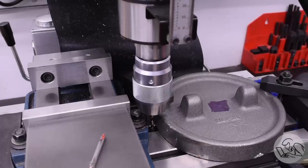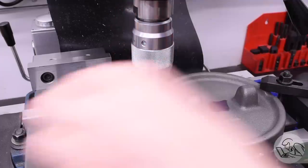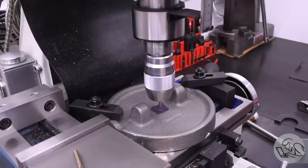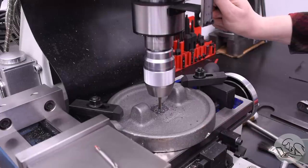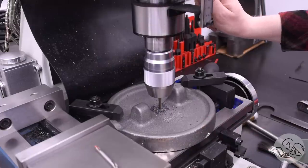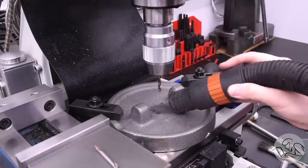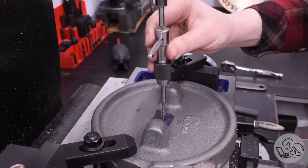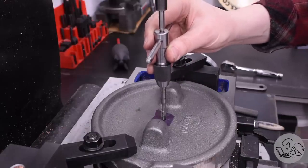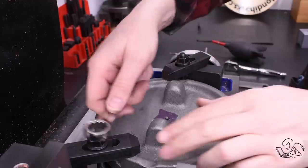I can double-check that I'm over the T-slot as intended — looks like I am — so I can drill through without hitting my table. I'll center drill it and drill through; I'm putting a tapped hole through the center of this casting. This is a temporary hole intentionally smaller than the final hole, and it's going to be used for several fixturing operations. This is all straight out of the build notes — a very good set of operations I don't think I would have thought of on my own.